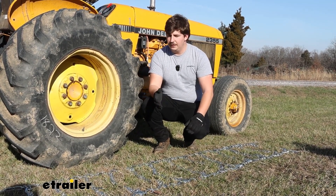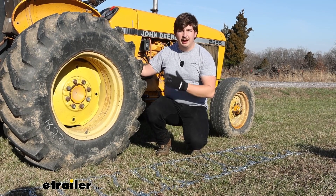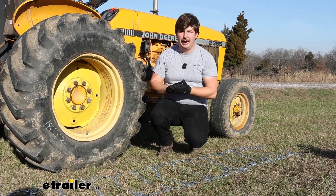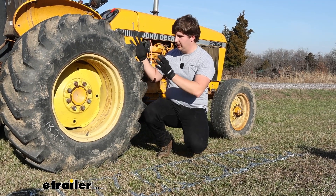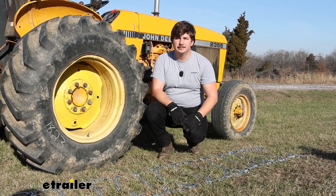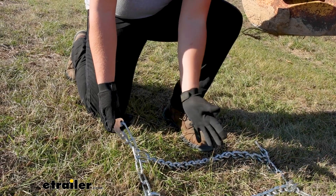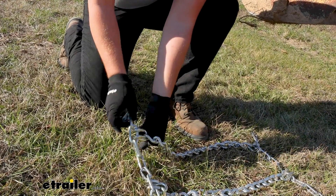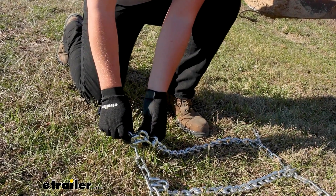The way we're going to do it today is with an extra set of hands, and I think that's probably going to be the easier way. We'll drape the chain over top the tire and have someone operate the tractor as we're carefully feeding that chain over top of it. Just watch out for your hands and feet and don't get caught up in the tire — you're essentially going to have someone here to keep it centered as we feed that chain onto the tire. Make sure that this lever is on the outside face of the tire, and that these crosslinks have a more smooth side and a more hooked side — we want that hooked side facing up away from the tread of the tire so it doesn't dig in.